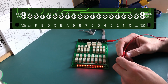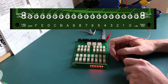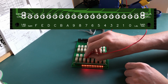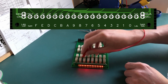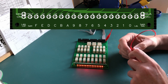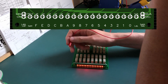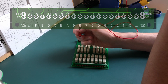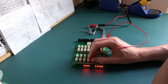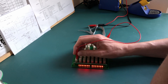Now likewise I can hit the load high, which is just down here. So again just being very careful, I'm going for this bottom left LED. And that just loaded those off — and you can see it's left this one behind. So that's doing exactly what I expected it to do. Just bring these back on again. I need a better probe for this actually — I should probably use it rather than hitting these with this crocodile clip. So the other function then is that as well as loading these independently, you can also load as a whole off of the address bus. So by hitting this top LED here, that loads the whole lot, wiping everything out.